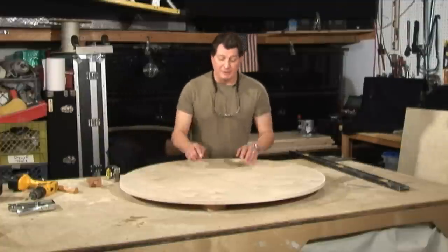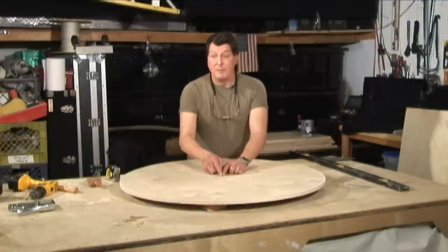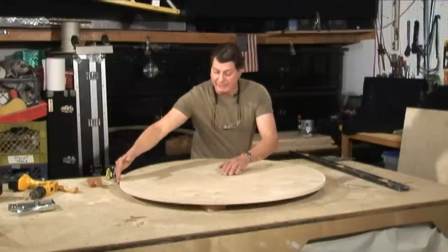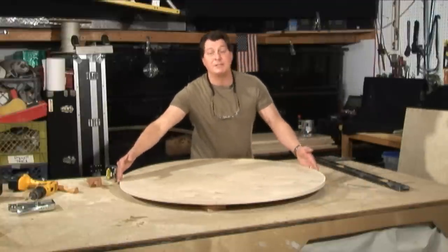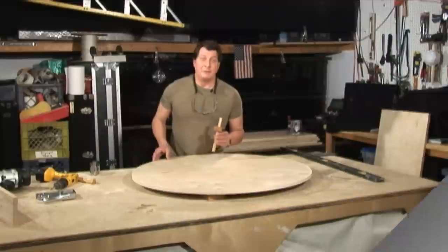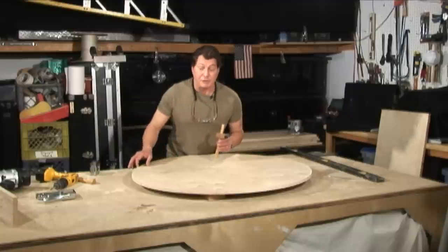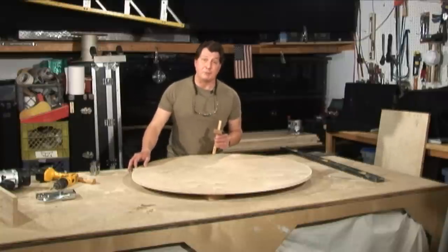So there's a trick on how to make a perfect circle — figure out your center point, measure out your radius, go ahead and cut that out. Doubling your radius equals your diameter, which in this case is 40 inches. This marking gauge set at 2 inches will scribe the inside of the circle and that'll give us a reference point for the outside dimension of our square base.